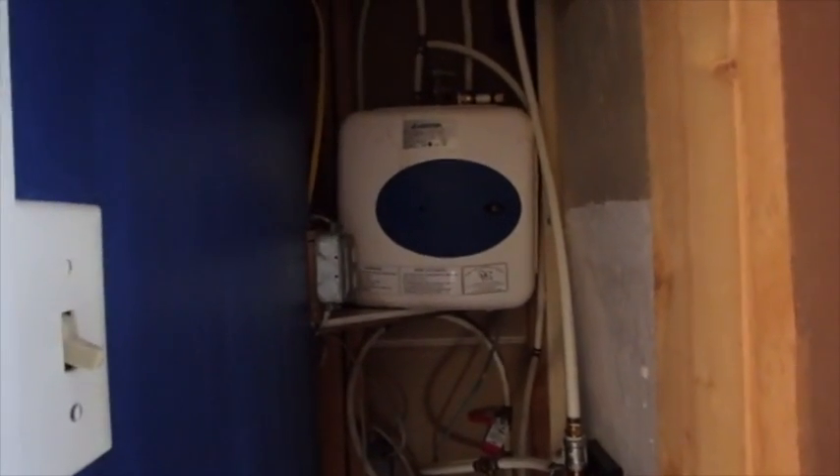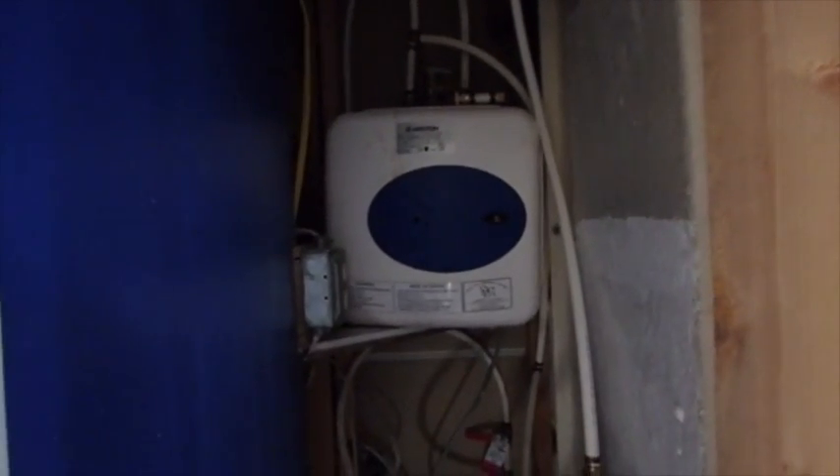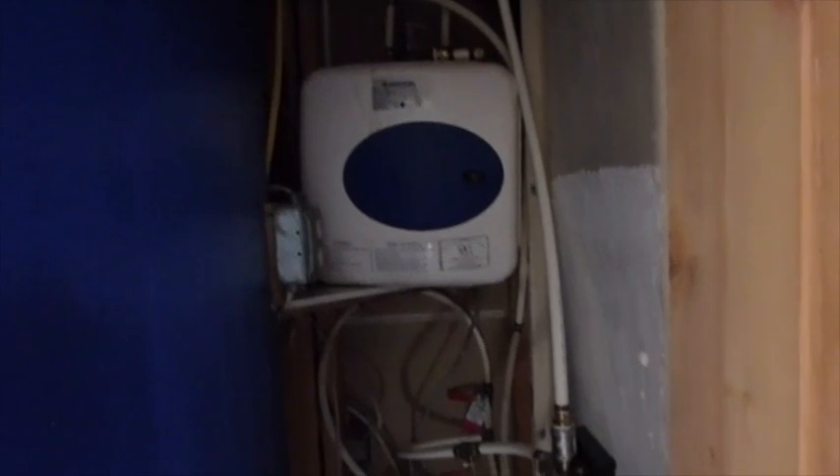You get in there, you have hot water almost instantly. By the time this runs out of water, you've got enough from the other heater so it's still hot. The hot water from the big heater down in the basement feeds right into the top of this baby. So that's how that works.